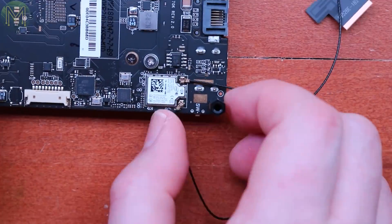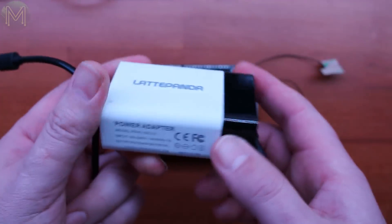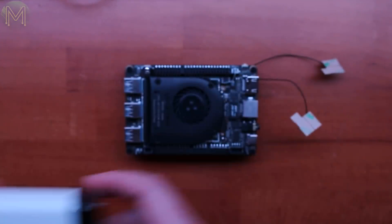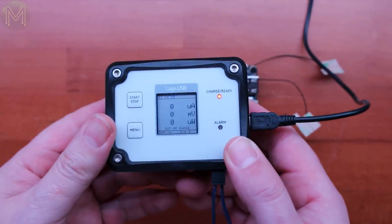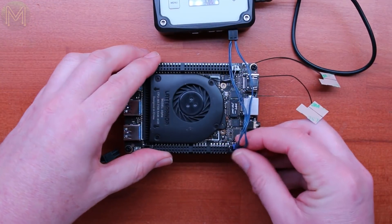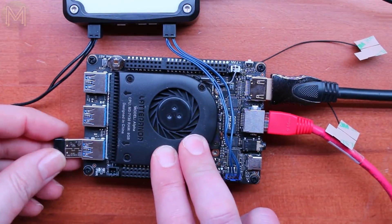Chucking the small antennas on is always a bit of a bugger. The Latte Panda Alpha is also a pretty power hungry SBC, requiring a 12 volt 4 amp USB Type-C power pack. Since I wanted to log the power consumption during all my tests, I used a power logger attached to the DC input header, which was attached to my bench power supply. Then Ethernet, HDMI, keyboard and mouse.